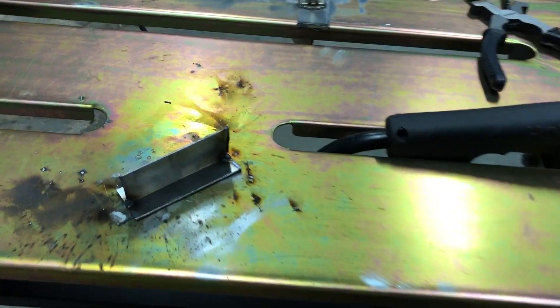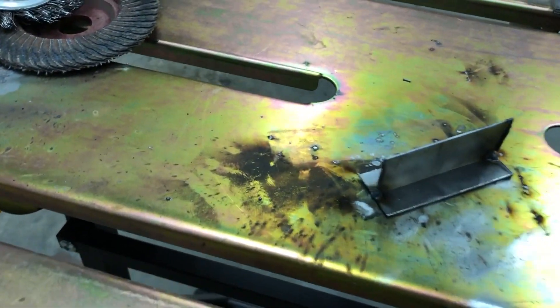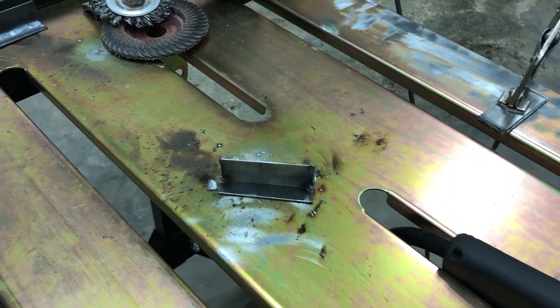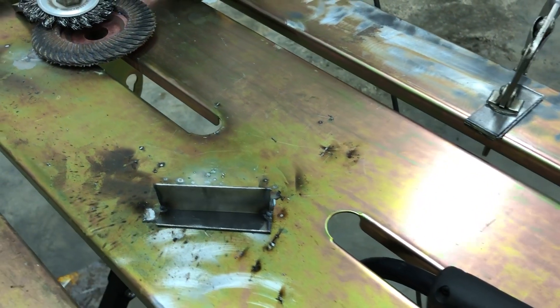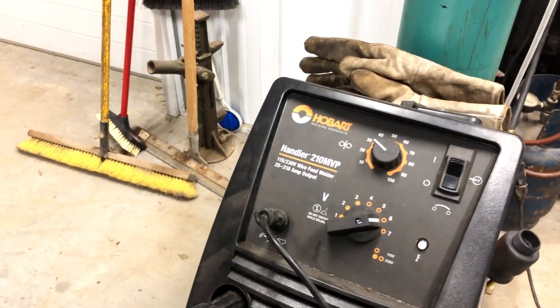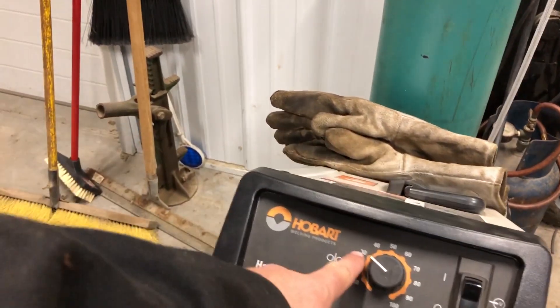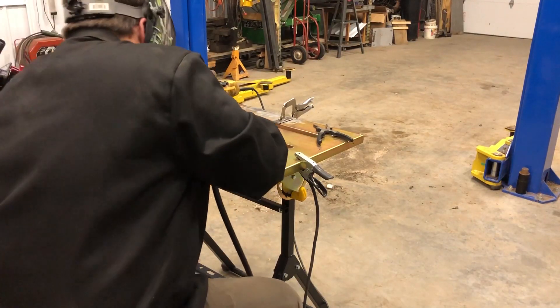I think I'll try and find some sheet metal to see if I can weld on 115 volts and show you guys what this thing welds like. Found some 16-gauge sheet metal — that's pretty thick compared to what this machine can actually do; I think it can go down to 24 gauge, but this is really all I've got. The machine is set up at tap 6 and roughly 30 for wire speed. We are on 115 volt now — let's make some welds.